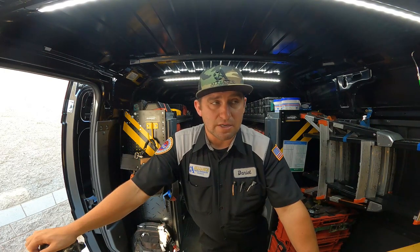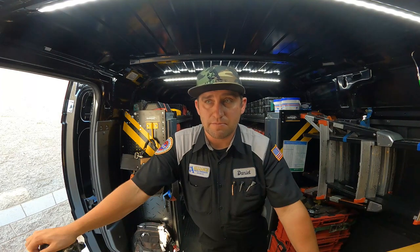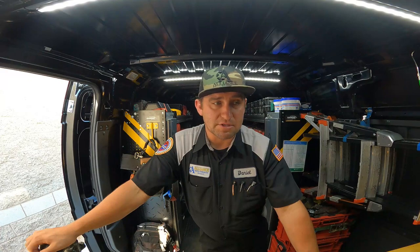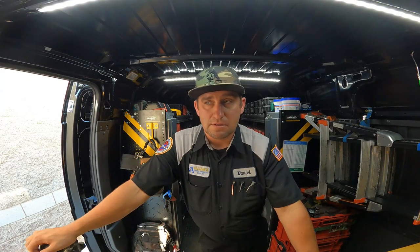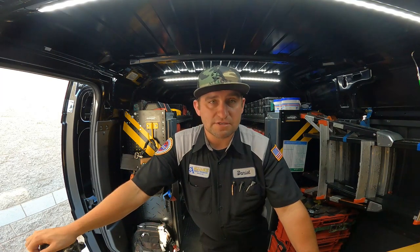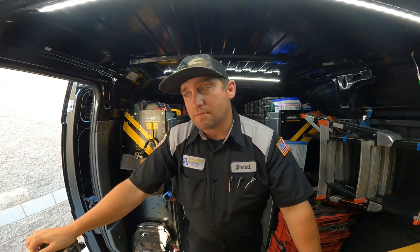I was up on the roof. I took a look at them and we got them up. He had the belts in stock, so I replaced all the belts, greased the shafts, greased the bearings, and they're back online. Just do your due diligence out there. Don't be tunnel vision when you go up there. Look around. Pick up the roof if you're up there. Make sure it's clean.